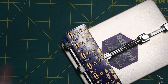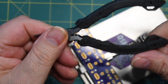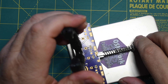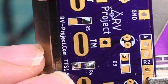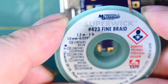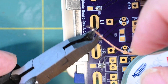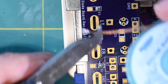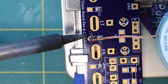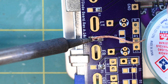At some point you're going to mess up, put the wrong component on, and have to take it off. This is a tip cutter made by Engineer, made in Japan. There's a little set of jaws — you'll probably destroy the chip, but you can see where I just cut it out. This is MG Chemicals Superwick, number 423 fine braid, 1.0 millimeter wide. As you use it, solder builds up on it — it's just copper braid, so you cut the solder-filled portion off to get a fresh piece. Set the braid down, put the soldering iron over it, and the solder wicks away.